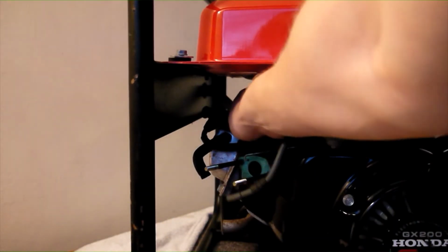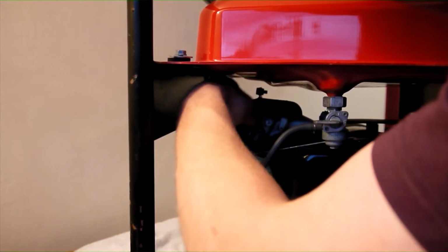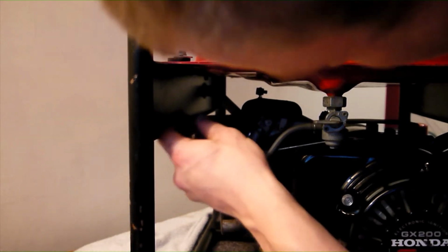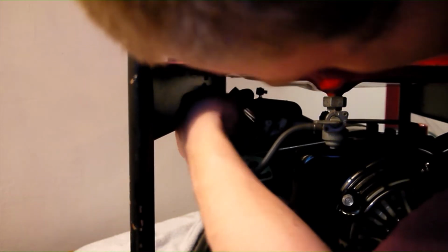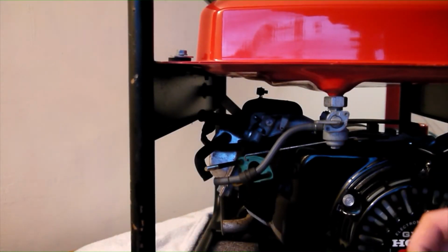Once the plug is fully seated by hand, you can use the wrench on the end of the socket to tighten the plug down. Again, it is not necessary to over-tighten. You run the risk of damaging the threads in the cylinder head as mentioned before, and are simply making it difficult to remove the next time you have to service the engine. The spark plug has inbuilt seals. Let the seals on the spark plug do their work.